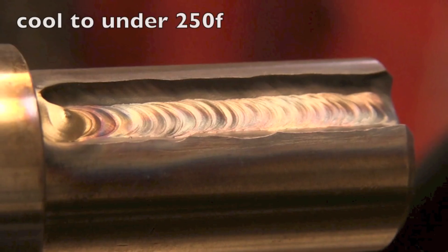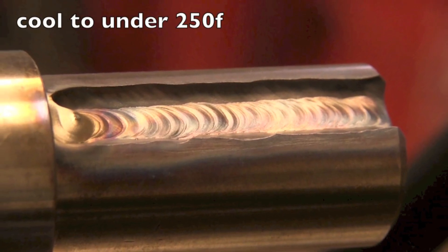For the most part I left the wire in the puddle using a lay-wire technique, and occasionally when the wire came out of the puddle I'd shift into dip-and-pause. It doesn't matter — it's going to be machined off — but leaving the wire in the puddle just seemed to work really well. Here I'm watching very closely the bottom edge of that bead to make sure I don't get into the base metal too much, just barely taking it up to the edge of where I melted off during the burn-down pass.